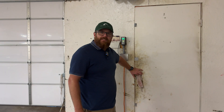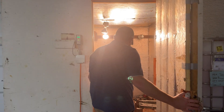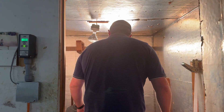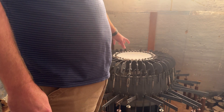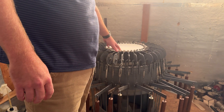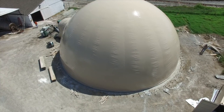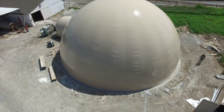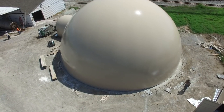This is the heat room — we keep it about 140 degrees in here. Inside this room we do multiple tests. One of those is a stretch test where we actually stretch the material so we can test how much it stretches, because all of our dome panels have to be compensated for that stretch, so that when you inflate it and it stretches out, it stretches out to the shape you want it to be.